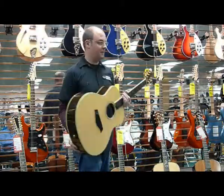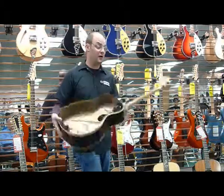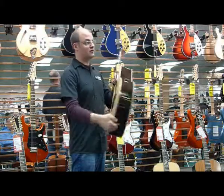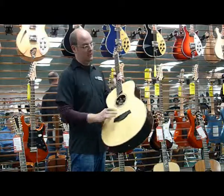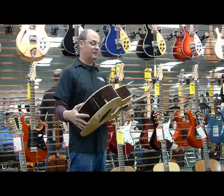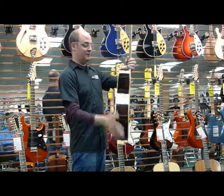When you're building twenty guitars a day, you have the space for the guitars to dry and cure. But when you start building three hundred guitars a day, you need a lot of room to store three hundred guitar bodies while they're drying. So what we came up with is using an ultraviolet cured finish. It gets sprayed on, goes into an ultraviolet booth — just the body itself, not the neck, which goes in separately.